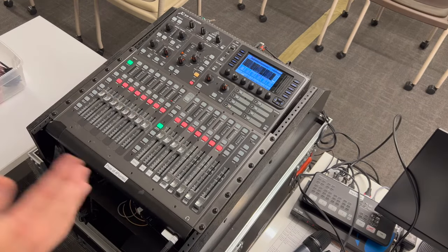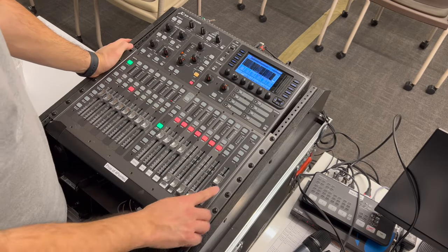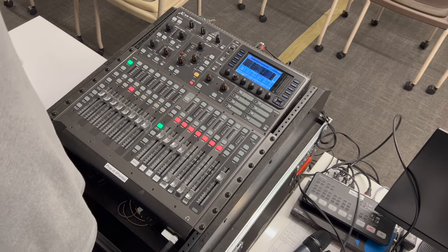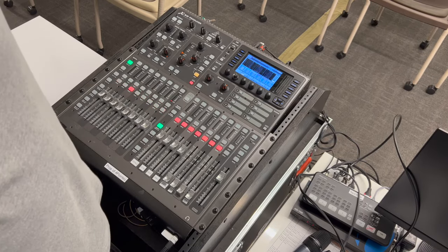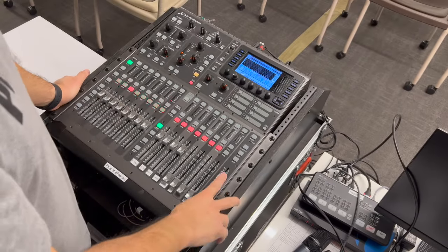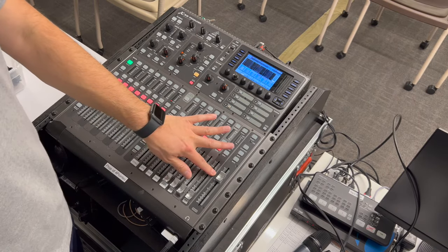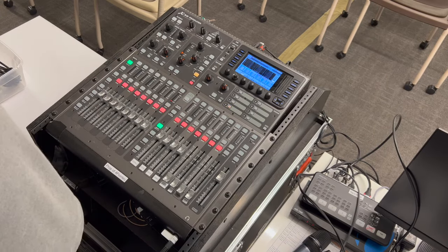That's how we run our services on Sunday. Generally we want the main fader to be at about minus 5 to 0. The Bose speakers at the top also have their own master gain — we want that set at about 4 o'clock. Sometimes it gets twisted or turned and might be too powerful. If we don't go up there and change it, we may just have to lower the gain on the mixer. If it gets decreased up there, we may have to raise gains here. The theory is to have everything at zero, and sometimes that requires going up to the Bose speaker to adjust its master gain.